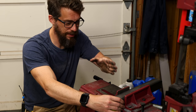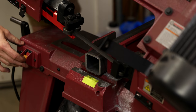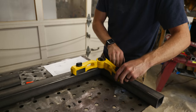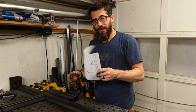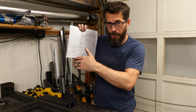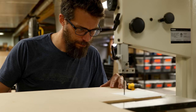Now that I've got one of these cut, I need to make the same angle on the other end facing the same direction so that the leg has a parallel top and bottom when it's sitting at an angle underneath the bench. The next thing is to figure out how to make the panel that goes on the outside of the legs to allow them to hinge. I worked in Fusion 360 to find the pivot point where the hole needed to be and where the whole thing could move freely in both its up and down positions. Since I did that work in Fusion, I'm going to print out that piece as a template and cut it out of MDF to double check in the real world.